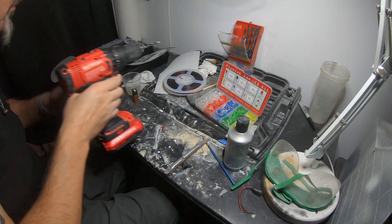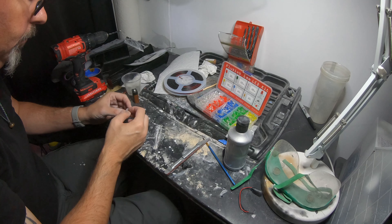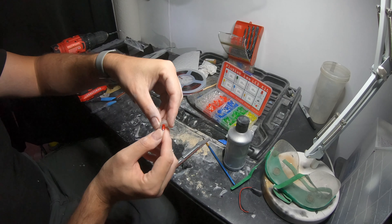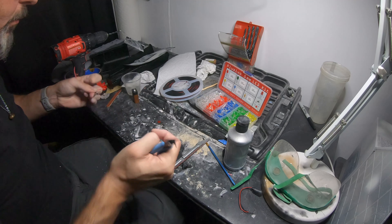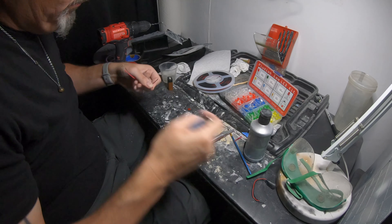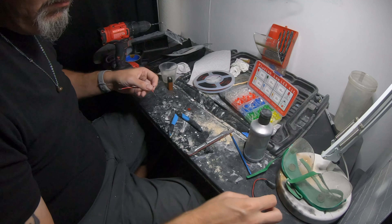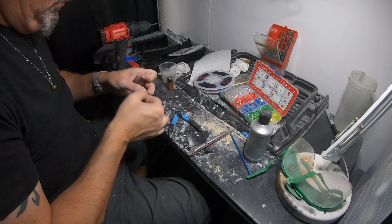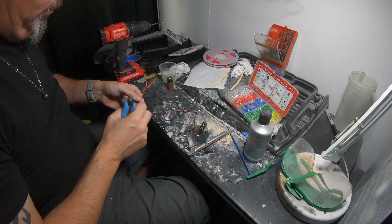As far as what I did in resin: I did anything that was internal, and the actual buttons and the light were all out of clear resin. What I found in the past is that connecting resin pieces don't normally work unless you scale back a little bit. So the pin I scaled back slightly, and the receptacle the pin goes into I actually scaled up just slightly. This was all done out of clear resin so I could put the LED behind the button light.